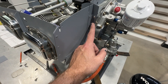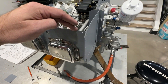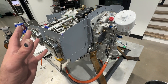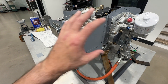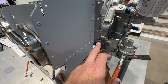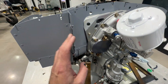There is just a little bit of thinking involved, but pretty much all the parts are diagrammed out and it's all fairly intuitive. One deviation I did from the plans: they call for riveting this angle brace to this piece, and that piece is riveted to this piece, so it would all be one piece and you can't remove it later. I don't like that — I like the ability to remove the pieces. So instead of using rivets here, I used 6-32s and some Tinnerman clips, and that way I can remove this piece separately.